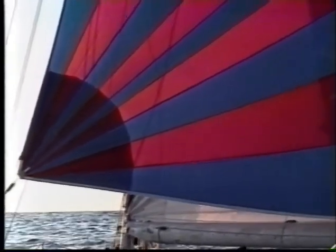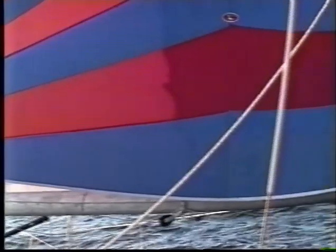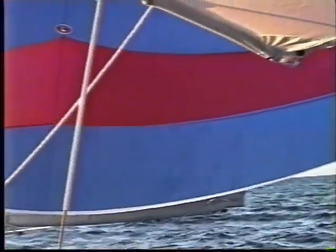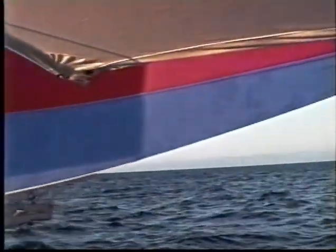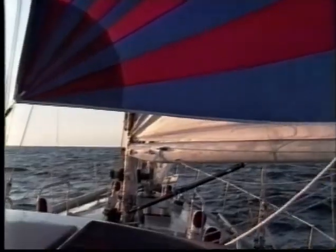The very efficient sails that are possible today make the Ketch a much more attractive rig than it used to be. Sundeer's mizzen develops almost as much power per square foot as does her mainsail. So we've made the mizzen quite large, reducing the main and forward triangle in the process. This makes the overall sail plan a lot easier to deal with.